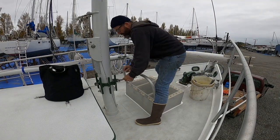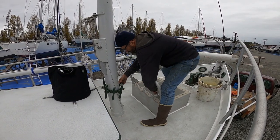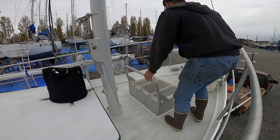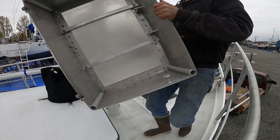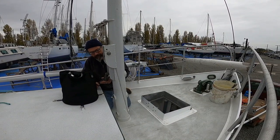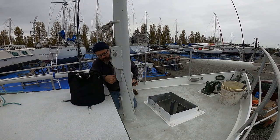Hello, my name is Steve and I'm the guy that does a lot of anchor testing. I use this sailboat Panopay. Several of you folks have asked me for details on how my mast tabernacle system works. A tabernacle is just another name for a hinge, and what this hinge does is allow me to lower or raise my mast without the use of a crane. I don't have to hire anyone — I can just do it all myself.